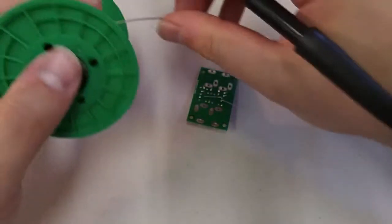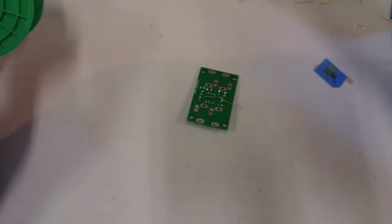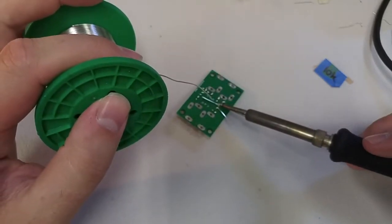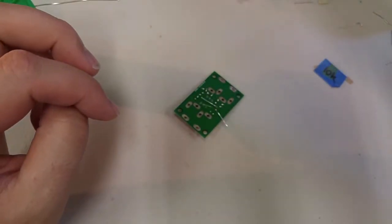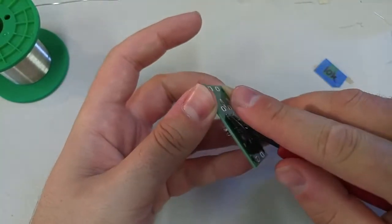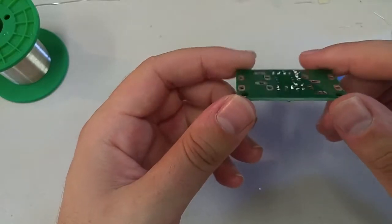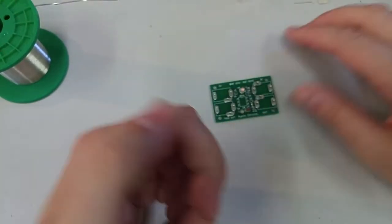So we're tinning the tip. Same process as before. You're familiar with it by now. Heat up the joint. Kiss the solder. Heat up the joint. Kiss the solder. Don't literally kiss the solder. It's poisonous. I mean, you'll probably live, but not with all of your teeth and brain cells. Okay, so snip off the little legs on the end. Got the nice Hershey's Kiss shape. LED is close to the board, so it's not going to wiggle around. Perfect.